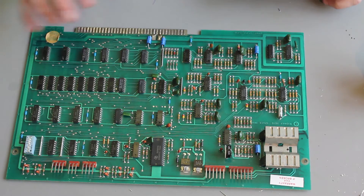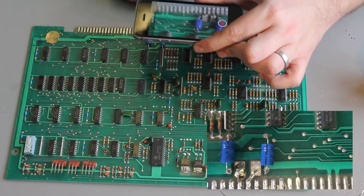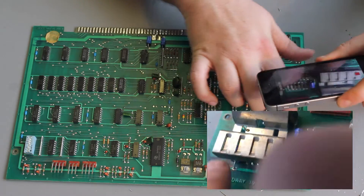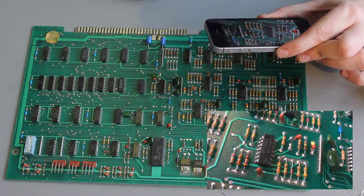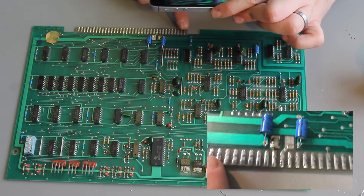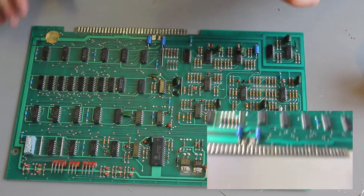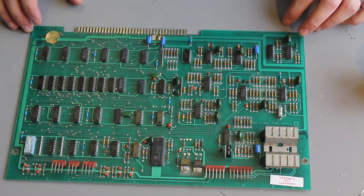The work on the driver board is finished, so let's take a look at what I've done. I've replaced the old electrolytic axial caps with these new Vishay ones — there were five on the board. I managed to replace the one hiding under the heatsink without removing it, which is a bonus. Nothing else on the board is really that much trouble; the board is essentially working. I've reflowed the edge connector with fresh solder to brighten it up and hopefully make a better electrical connection when it goes back into the motherboard. Now all that's left is to reassemble the two pieces, go back to London, put it in the cabinet, and play it.